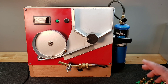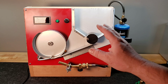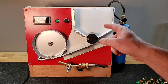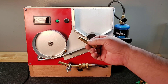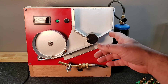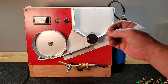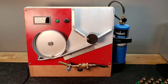I built this two years ago and it's worked great with no real issues. Whether annealing actually makes your brass more accurate I don't know — I haven't done a side-by-side comparison. What I can tell you is the brass lasts longer: I don't get case cracks around the neck anymore and I get a few more loads out of every piece. Also, annealing every time guarantees the brass is exactly the same each time — it's not going to be work-hardened or inconsistent. That's why I built the case annealer.